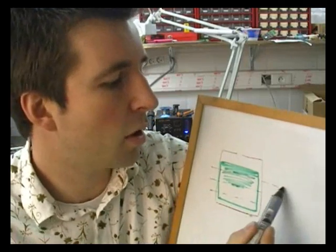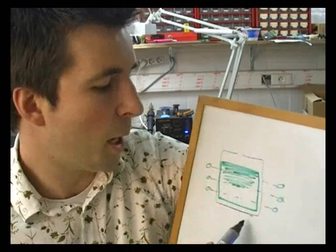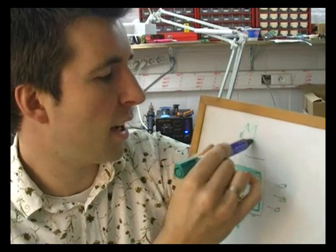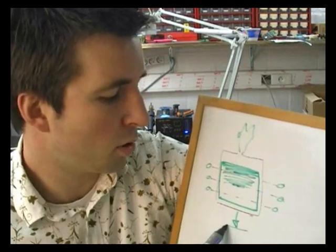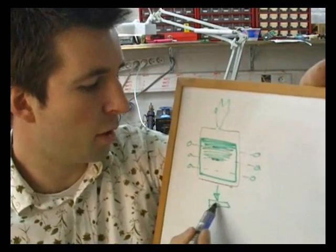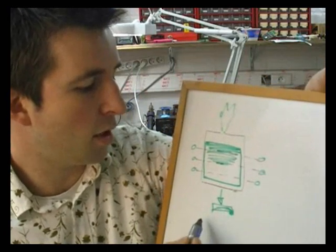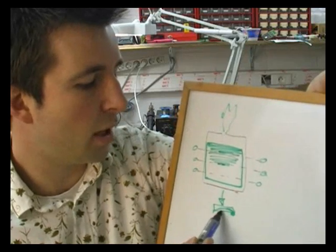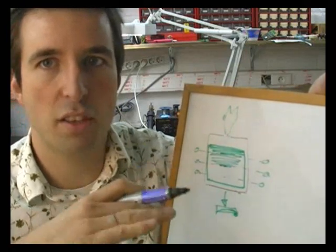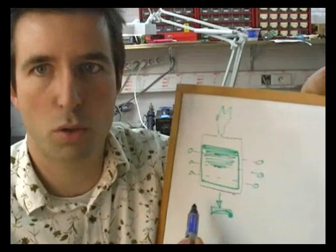But we're going to need some electronics to hook up to these break wires and to measure the actual speed. We're also going to measure the thrust that comes out of the motor as the gases escape. We're going to put a load cell under the motor, which is basically sort of a beam arrangement that's fixed at one point and that can bend on the other point, and with strain gauges on this load cell you can electrically measure the deflection of the load cell, and so the thrust of the motor as well.